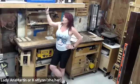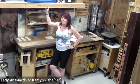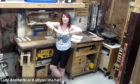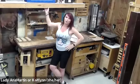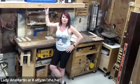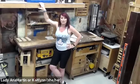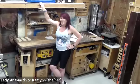First off, they are 2x4s and instantly recognizable as 2x4s from anywhere. Second off, they're not particularly stable in use. They don't weather very well. They're not particularly strong versus deflection, bending. So if you've got a ridge pole made out of a 2x4, you'll notice over not very long, it'll start to sag and bend. And if you're not taking care of it, oiling it, or putting on some kind of finish, it'll get weak and eventually it'll crack. And they're very, very heavy for what they are.